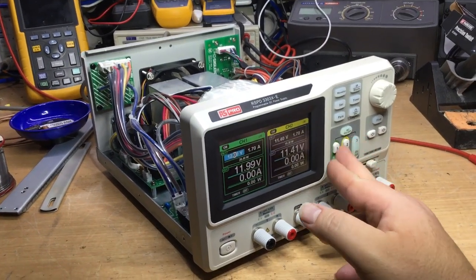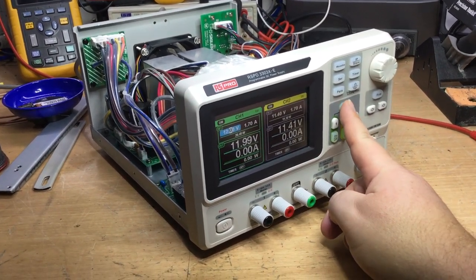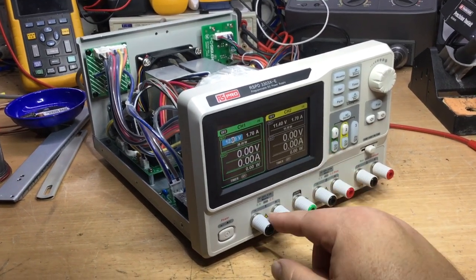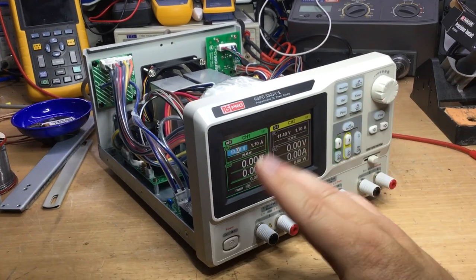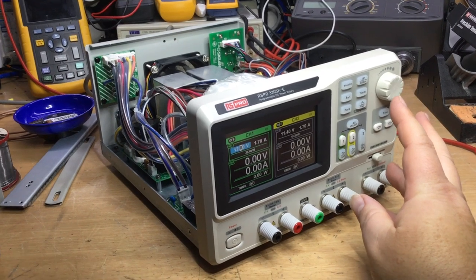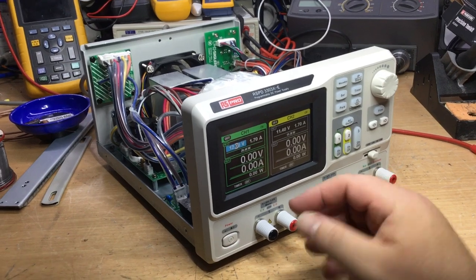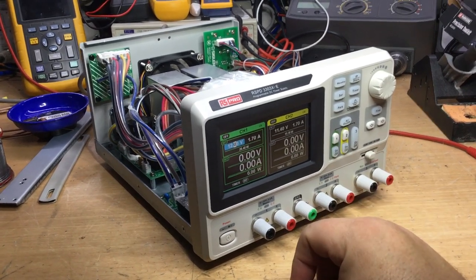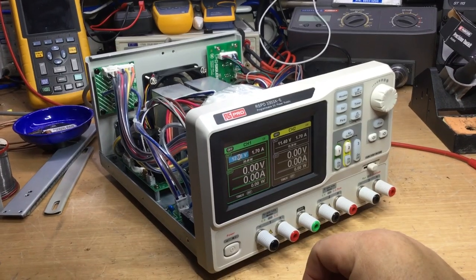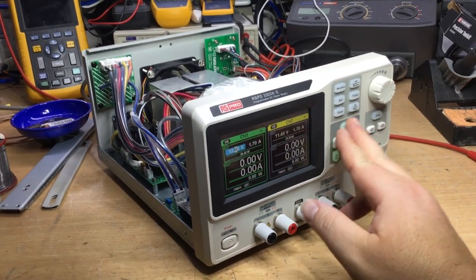And then obviously, once I've disassembled it all, I need to be able to look at the voltage on the output of those two regulators, because they're the ones that supply all the logic board with all its power. And I think something in that power circuit's going off. Either the bridge rectifier is breaking down with temperature, as it's getting really hot, like it was when I put my finger on the end, or it could be that the voltage regs have got a problem as well. So I don't know, it seems a bit strange.